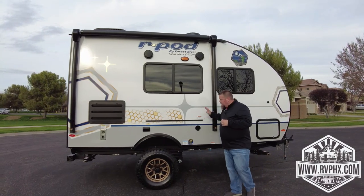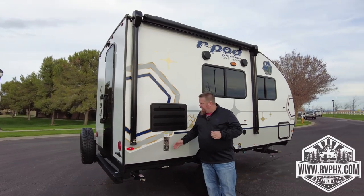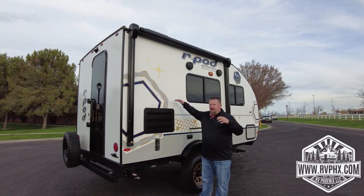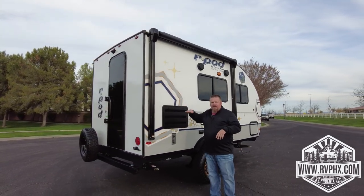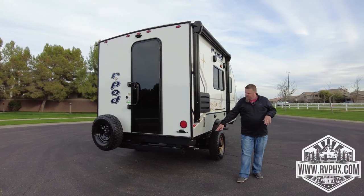As you come around, this right here can get really hot — it's an exhaust vent, so make sure you're not leaning any gear against that. You shouldn't be leaning any gear against the RV at all. Don't put a pop-up tent or anything right by it that could scrape it in the wind. Just remember when you walk inside the RV will wobble a little, so if something's leaning on it, it'll rub and you could tear the stickers.